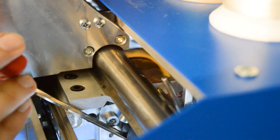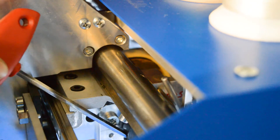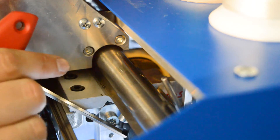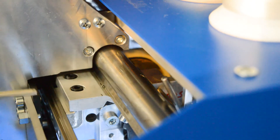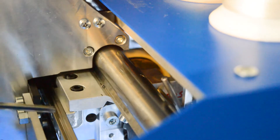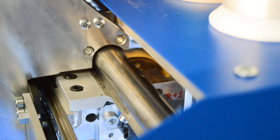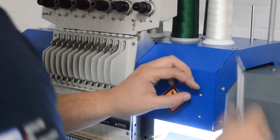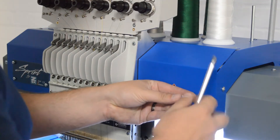Hold it there and then tighten up that screw. Now you're okay if it's close — I would say 136.1 or 135.9 is fine, but get as close as you can. Then once you've got the screw nice and tight we can remove the pin. And that's the head timing done. Now we can put it back together and pop this blue cover back on.